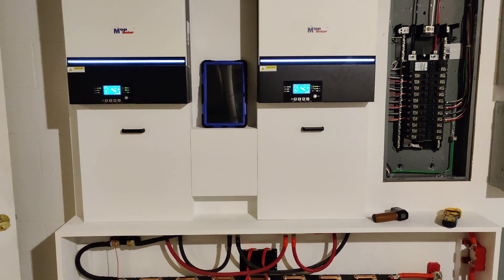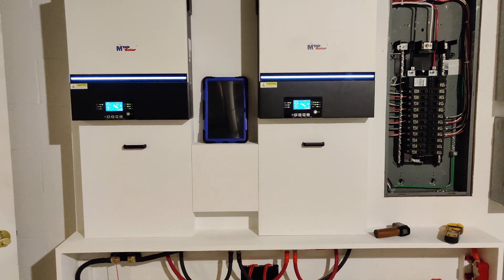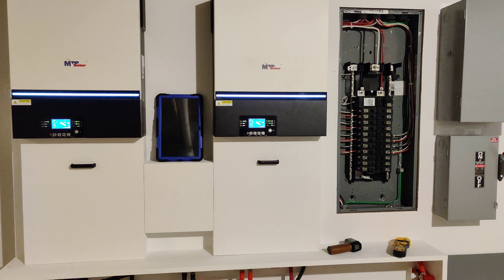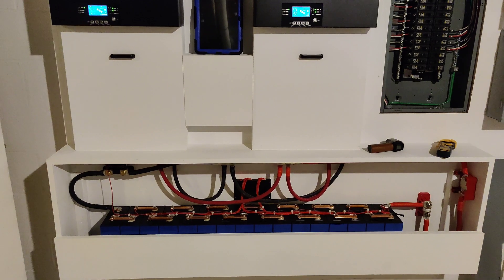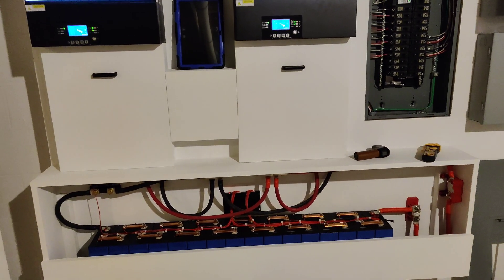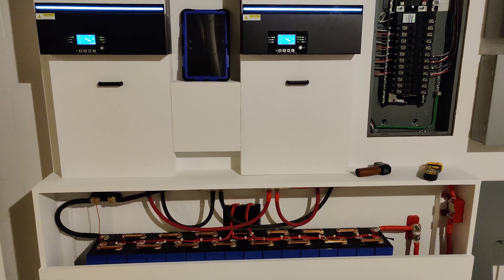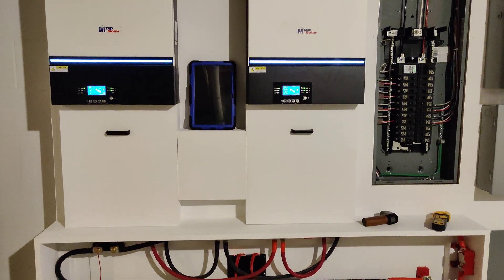The batteries are disconnected from charging — I'm only using my battery bank right now for backup until I get my solar panel. I don't want to leave these lithium batteries charged at a high voltage; it's not good for them. They settle down to about 3.325 volts at that 52.8 float. I don't want them going into float really — that'll put you at 3.3. So that's the setup and I'm very happy with it.